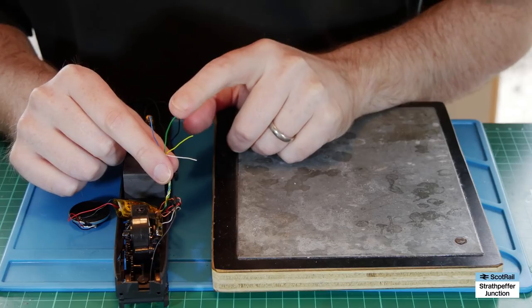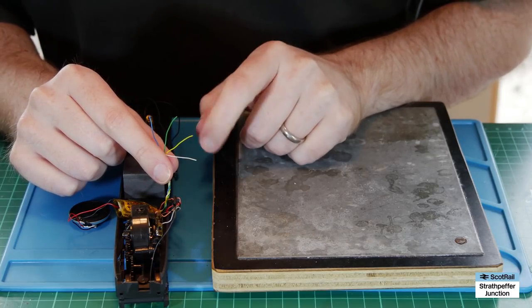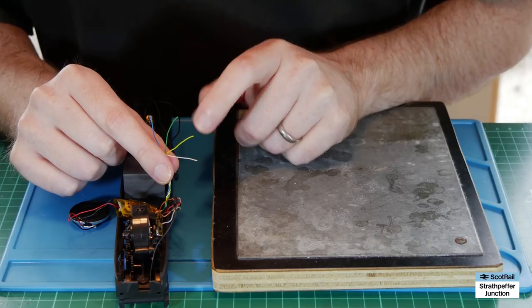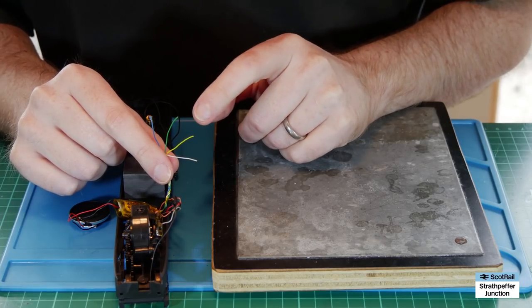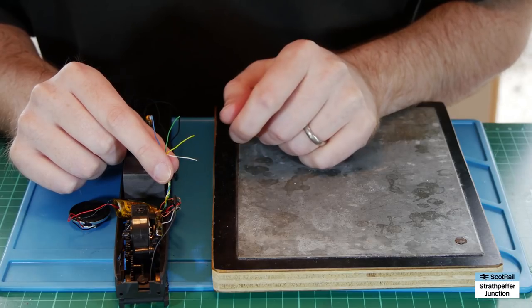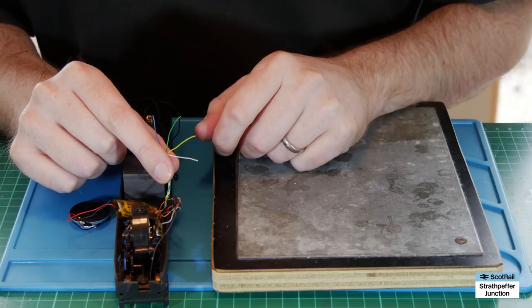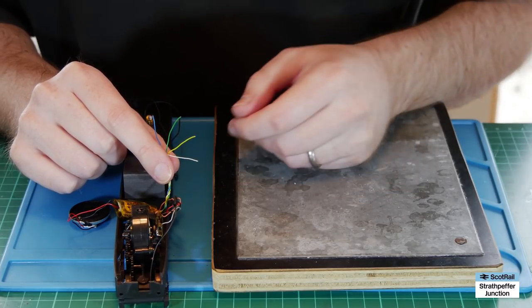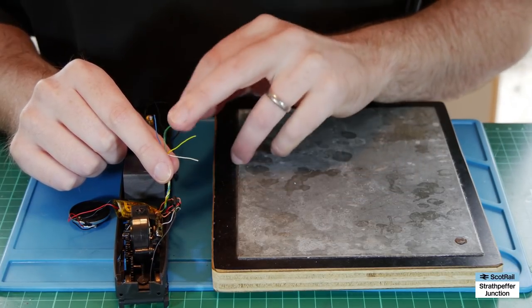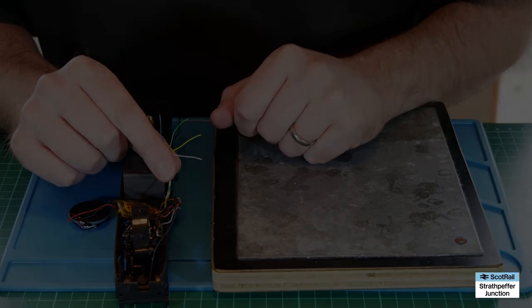So I'm going to take this away and quickly insulate the cable before we move on to the other three of them. What I use is a hot air gun, but you could use a cigarette lighter or even a flame over a stove if you're very careful. But heat shrink, well, it doesn't go on fire, but it can hold a flame for a bit of time, which isn't what you want. So if you've got one around, a hot air gun is the way to go.